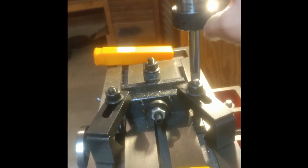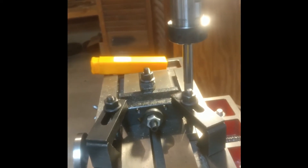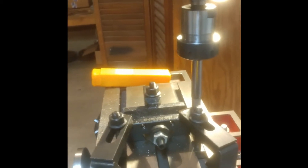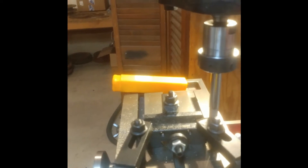This one comes with, I believe, an M10 thread. The drill press does not have a full bore all the way through, but it does have a cross slot that's meant to knock your Morse Tapers out when you need to change tools. What I've done is put a crossbar that goes into that slot. I took an M10 bolt on my lathe and drilled a small hole up through the center of that bolt, threaded it into the end of this, and then a small bolt runs up through the center and into a crossbar that fits in the slot. That draws the Morse Taper right back up into the spindle tight so it can't fall out or wiggle. It's nice and tight once you tighten it all up.